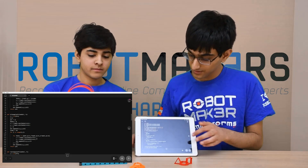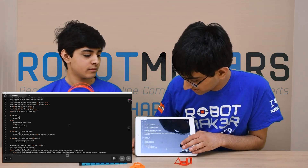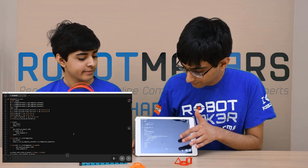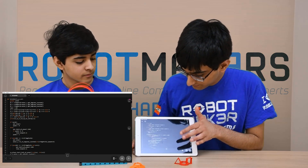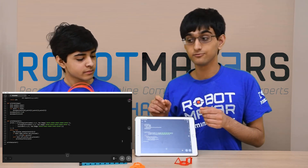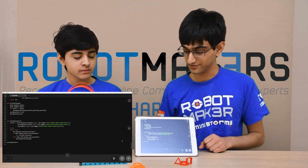It uses a series of trigonometric functions to calculate a series of points to which the pen should move. Then, using the synchronized motor pair command, we are able to accurately move the pen to each x, y, and z position using a special function up here. And then we finally define a menu system towards the bottom, which allows the user to select which print to do, and it displays it on the screen. When the user presses the left button, it starts printing.